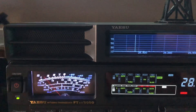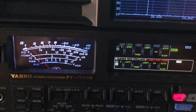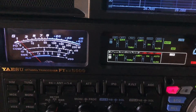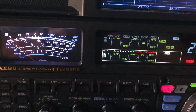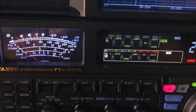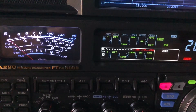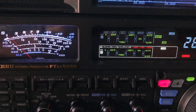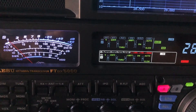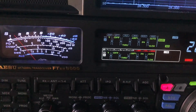Anyway, I thought I'd take advantage of that opportunity for you to see and hear what power line noise sounds like. And I'm going to end this on a high note with the noise blanker. Now the noise blanker's — it's getting a little worse as the day goes on. Turn off the noise blanker. See, it's up to an S2 now. And the noise blanker is pretty much handling it. Now the wide noise blanker may be able to knock it down a little lower. No, not really. So that is power line noise.